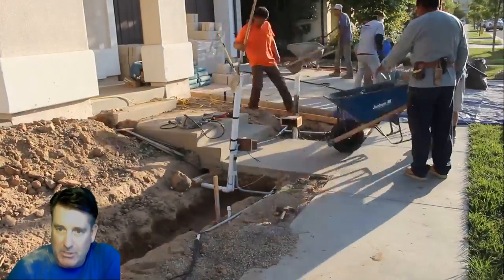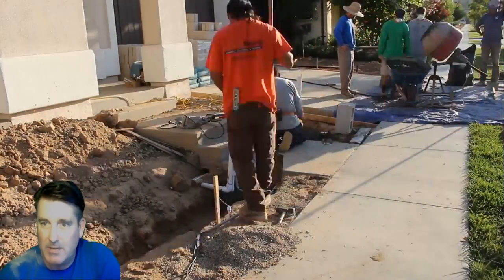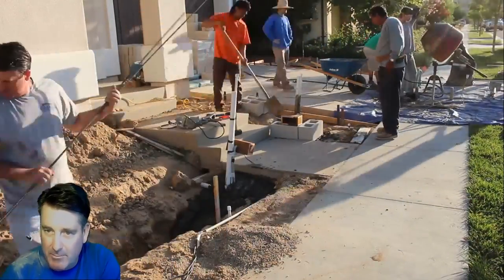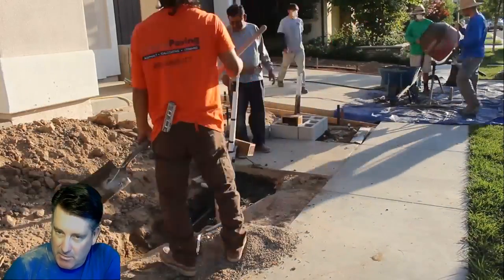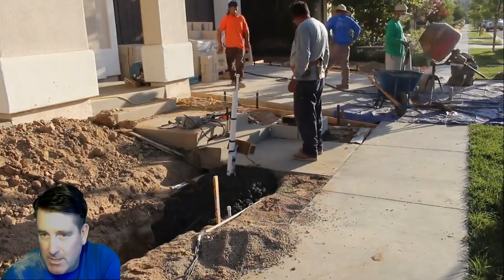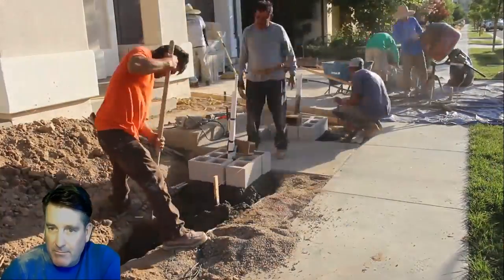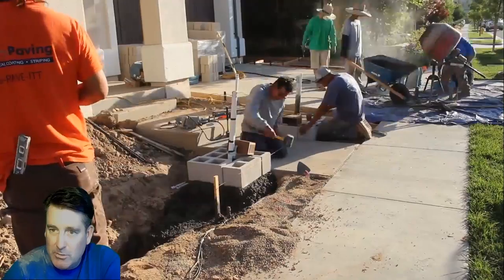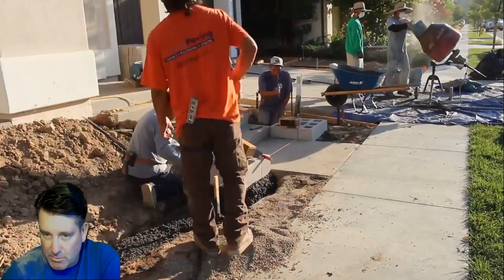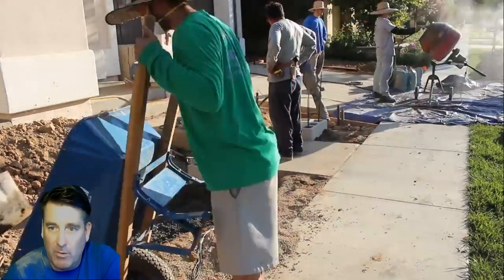You'll notice the dirt on my shoulder — I just walked in from a job site and I'm jumping right into this video. We're going to mix the concrete by hand. I'm using 4500 PSI today. I like the 4500 PSI because it goes off quick and it's a lot stronger than the basic pre-mix bag. You can set your block on it and it's going to dry fast so you can continue your build.